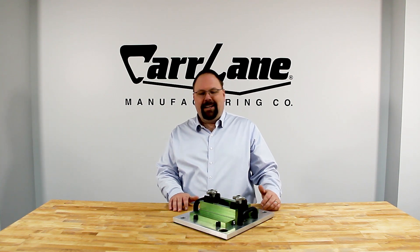Hi, I'm Colin and today we're here to talk about locating principles. Locators are one of the key elements in any jig or fixture solution. Locators perform a critical function in that they constrain the degrees of movement of the workpiece. What this means in the most common CNC machining applications is that we need to constrain the workpiece in both the x and the y-axis.